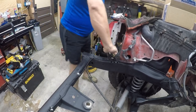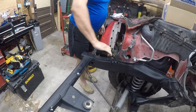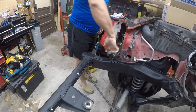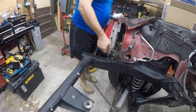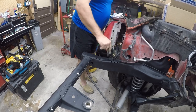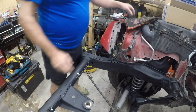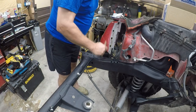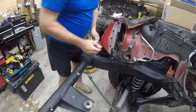So this isn't so bad now that I've kind of got this down. And these aren't perfect threads because, again, I'm a 64th of an inch large on my hole. So if I was doing something structural, this might be a problem. But this isn't structural. These are hold downs for a brake line.